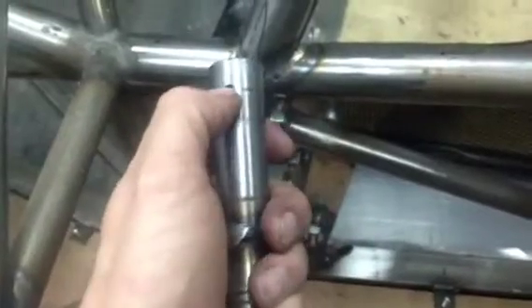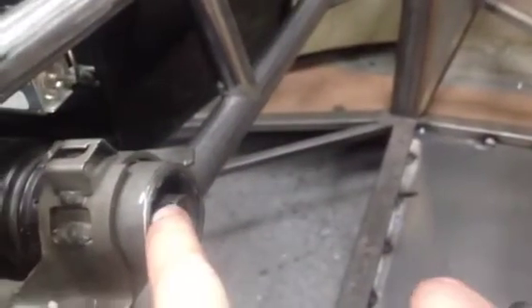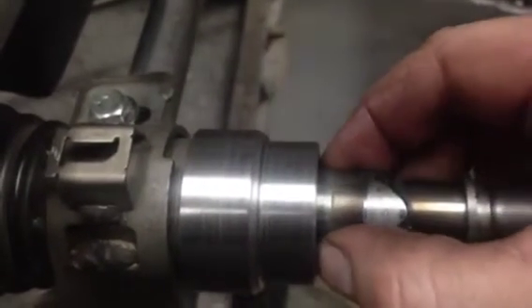Then drilled and tapped two grub screws in here. What you can't actually see is there is a spline, then an undercut, and then another spline. Basically these grub screws now line up with that undercut. Once the grub screws go in and I lock-tight them, the steering wheel won't come in and out at all - it'll sit on there. Just to make it so I can take it apart if I ever need to replace anything on the power steering unit - I can take this piece off, take this piece off, and replace whatever needs replacing at the back. So eventually we'll have that on there, and you'll see it'll fit inside. This is the plain bore of the bearing - that'll go in there and that'll be the bearing.